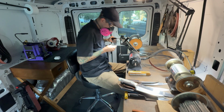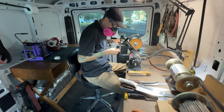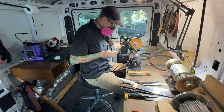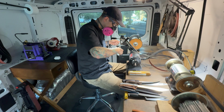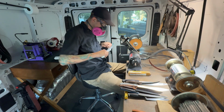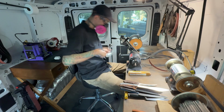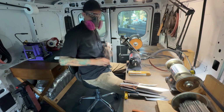First of all, you should really be using no pressure at all and just holding it against that belt as light as possible. Then when it comes to the actual movement involved, what happens when you approach the tip, and you can see me doing it here, so the handle gets pulled towards you a little and the tip gets moved down just ever so slightly while maintaining that extremely light pressure. I find that helps achieve a really ideal edge profile.